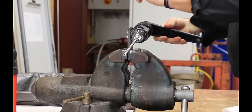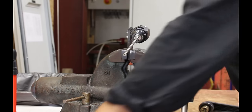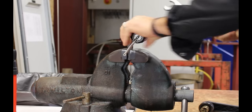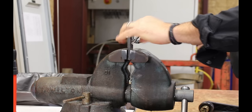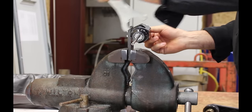Back the nut off. Loosen the nut up, then you can slide the tube forward and tighten it up. This will allow you to hold the tube while you're doing the threading operation.